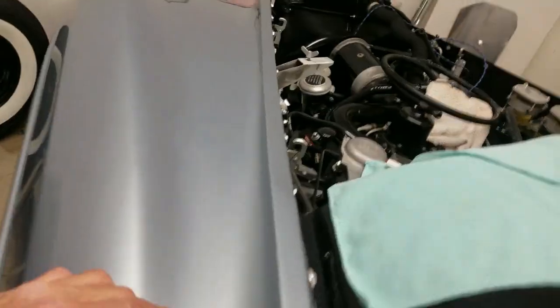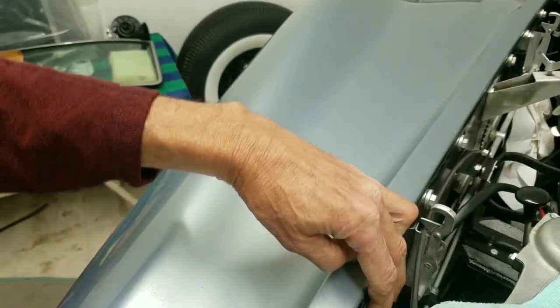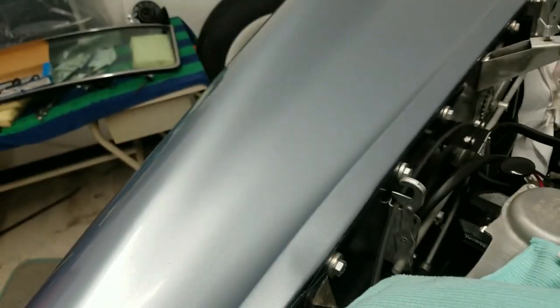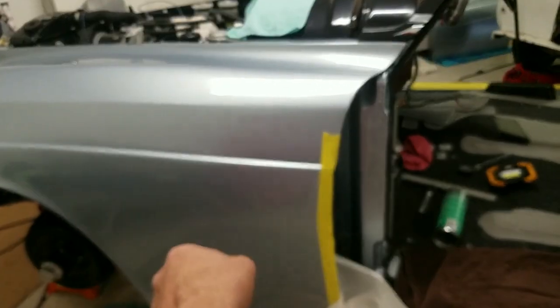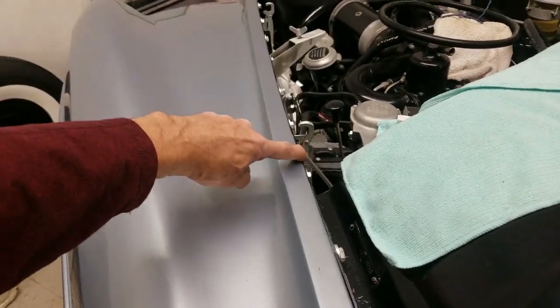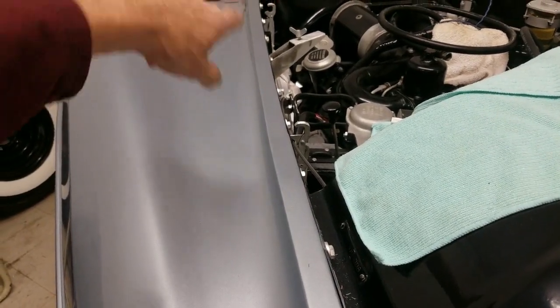Since the wing was all loose on the inside, I went ahead and took a long probe and put it in one of these holes. I was able to center the holes and with a little bit of effort move that black inside wing around. I also used the hole where I left the bolts out of the plate to line that up. Coming down the fender there's kind of a natural dip right here, but I made sure I was level all along that - the top of the fender and the black wing. And then I started tightening the bolts down from the back to the front to pull it in.